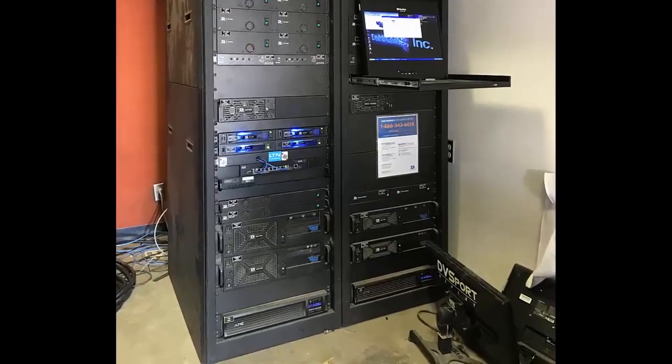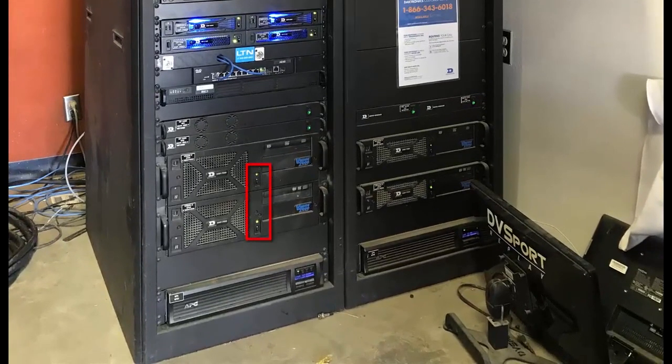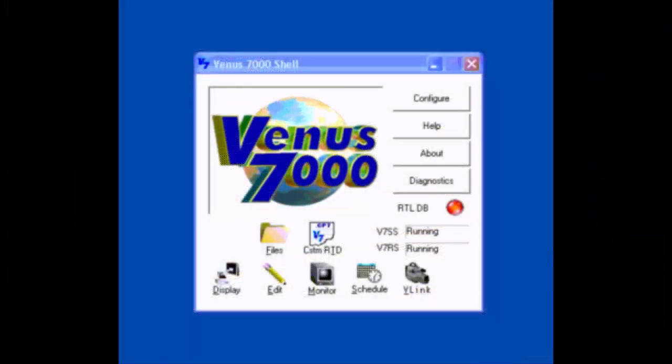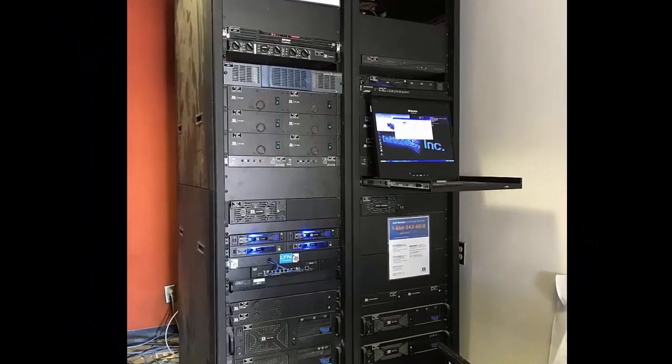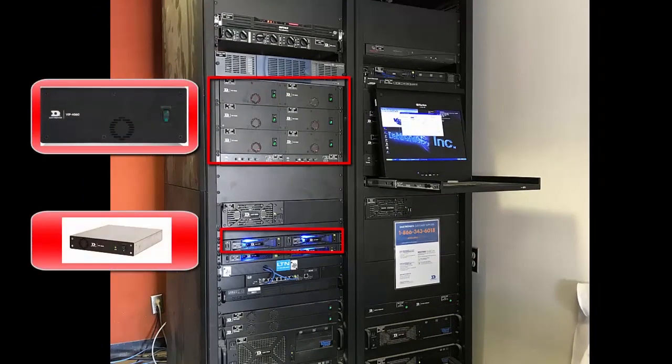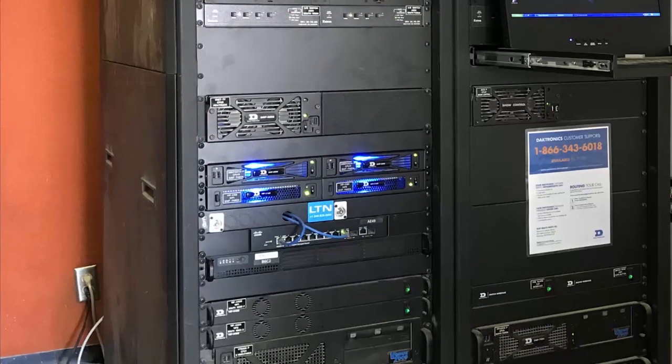Turn on any DMP 7000 computers on the desktop, wait until the shell window opens and the world graphic spins on all 7000 computers before continuing. Turn on any VIP 4060s, VIP 5060s, VIP 5160s, and wait 2 to 3 minutes for the computers to boot. Indicator lights will blink on the front of the VIP 5160s when ready.